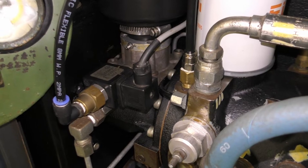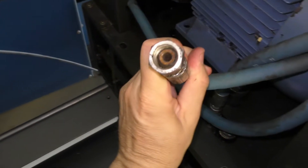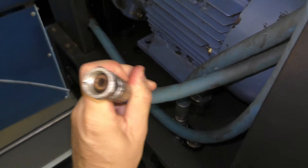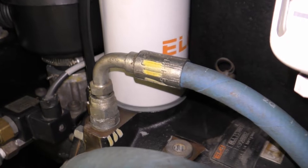What did we just see? We just saw, just by connecting that one hose which was vented to atmosphere, a 1.6 bar pressure increase. So just to go whatever that is - 400 mil, not even 500 mil, half a meter of hose - it took 1.6 bar.